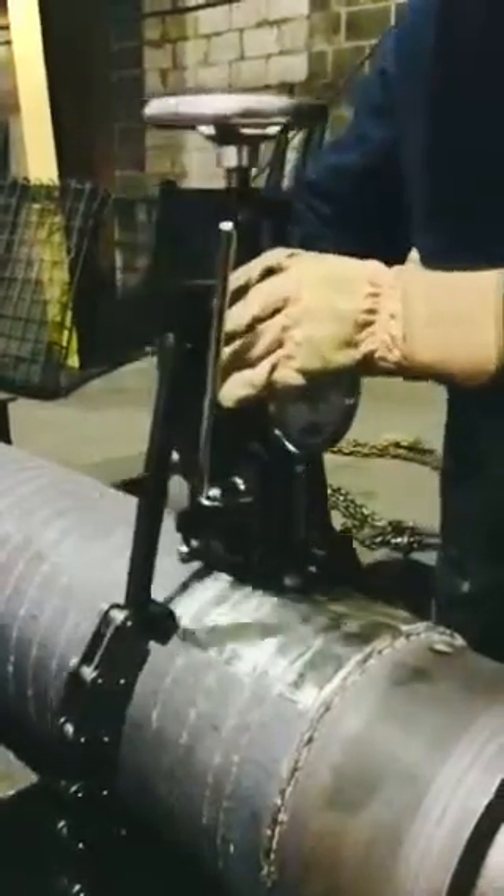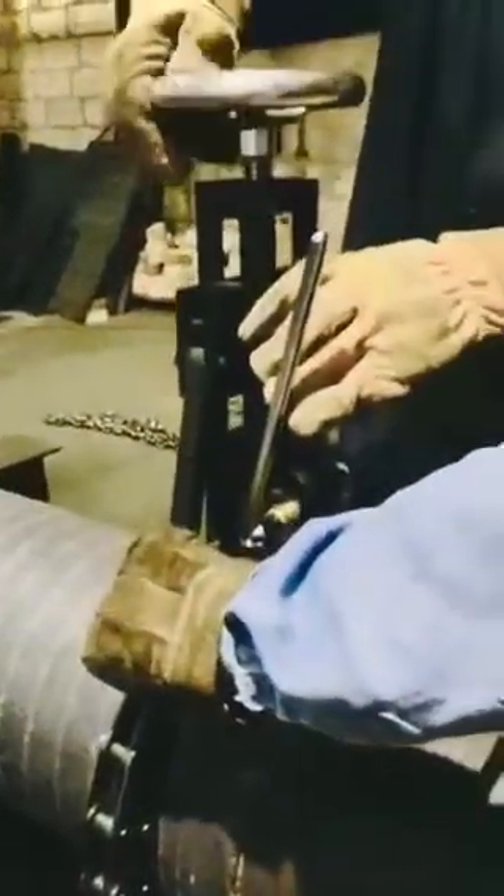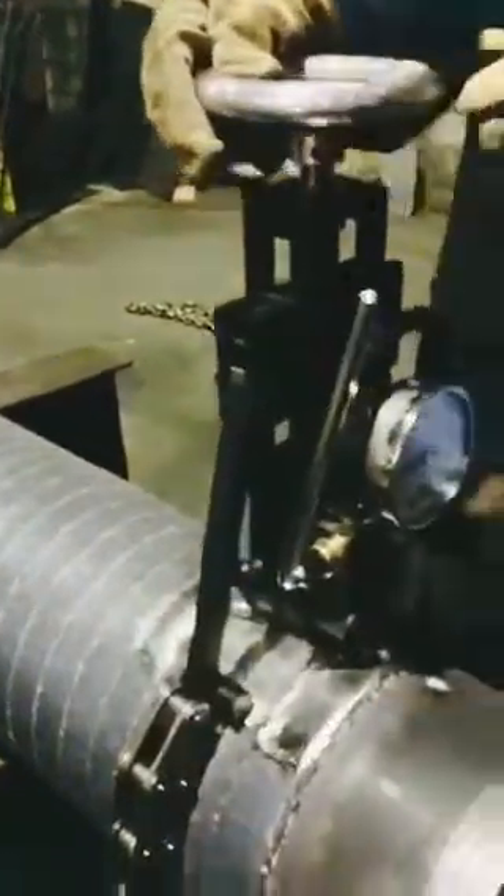The adapter is taken like this. You set the adapter, you bring the chain up to it. Now we're going to bring the 10 millimeter ball so that it touches the top of this cylinder. Nice and tight, 10 millimeter ball's there.